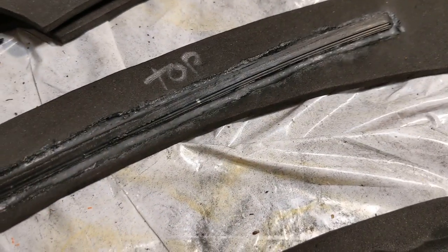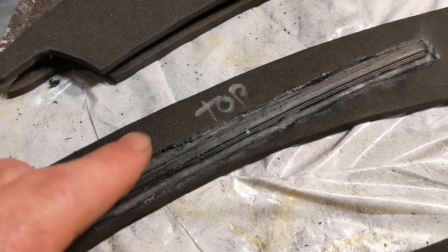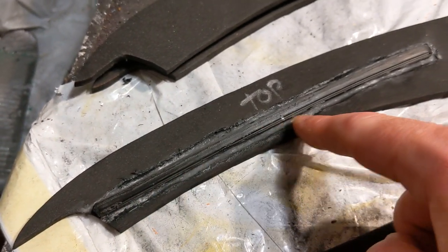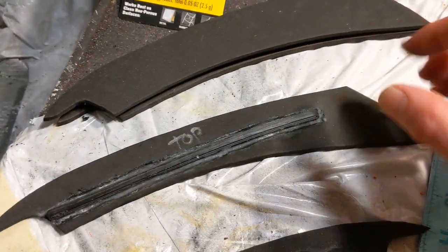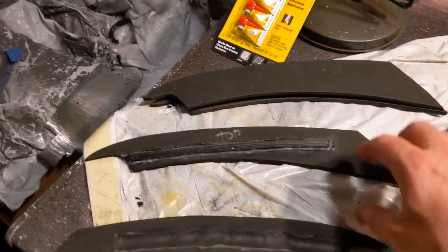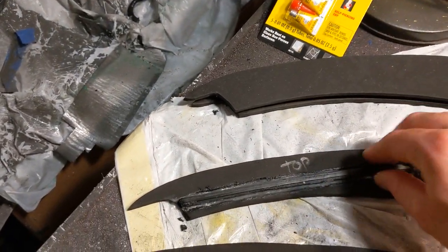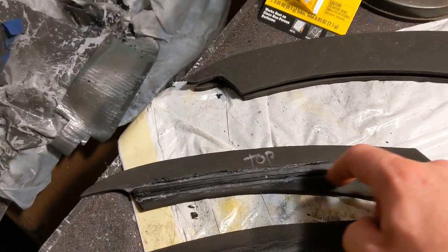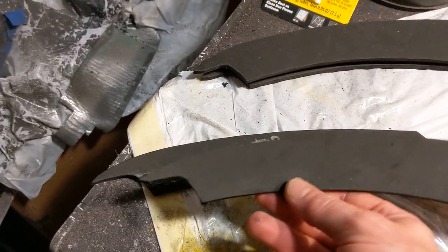If you're noticing all this white stuff around here — once I get this pressed and glued into place, I take super glue and run it alongside like it's a moat. Then I take baking soda and put it down over top of the super glue until the super glue absorbs it all and let it sit for about a half hour, then come back and shake off the excess. What that does is form a much stronger bond. It's really hard to get plastic to glue, but this will make sure it's not going anywhere. Also the super glue and baking soda when hardened is almost as hard as glass, so that'll also help make it stiff.